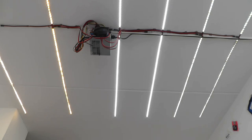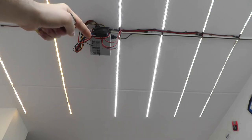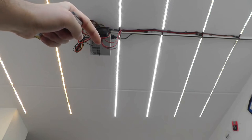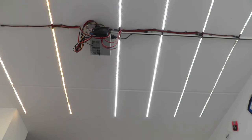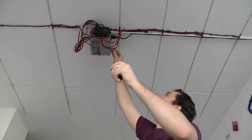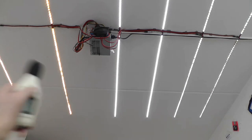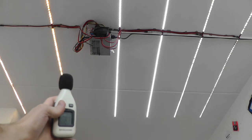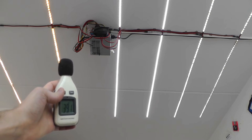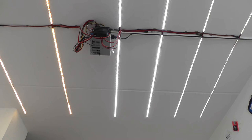For a system meant only to produce light, it's pretty noisy. There are two noise sources: the fan cooling the board and the fan inside the ATX power supply — which is the loudest. The hum also comes from the power supply. To demonstrate the difference, I block the fan of the ATX power supply: you can hear quite a difference — now only the hum remains, measuring around 39.1 dBA.